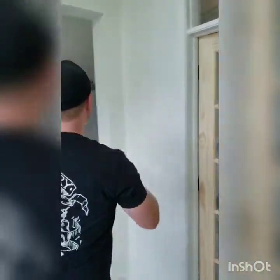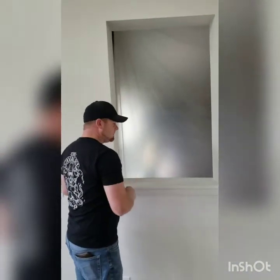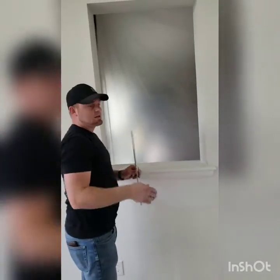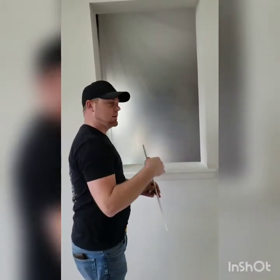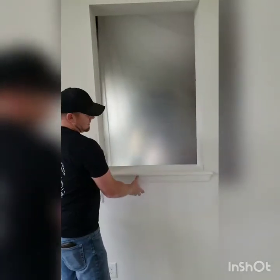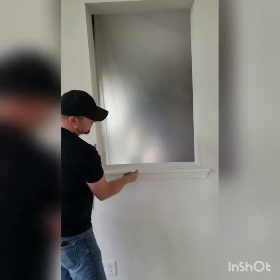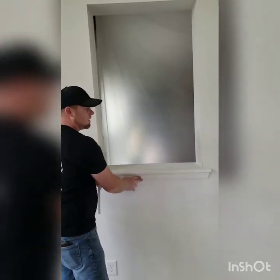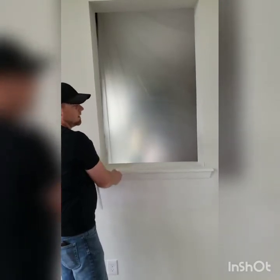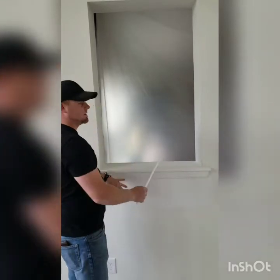On this opening right here, the homeowners wanted a bi-fold door. The problem was it was too far down to cut the door in half where the trim is. So what we did is we took a 2x4 and just furred this up — it used to end right here. We brought this whole thing up a 2x4 width, put drywall on it, removed the top cap and moved it up. Re-caulked it, re-mudded all this, and now it's all ready for paint.